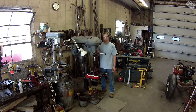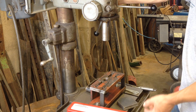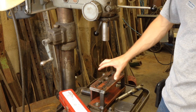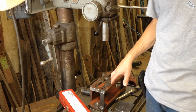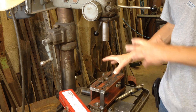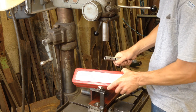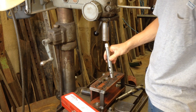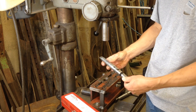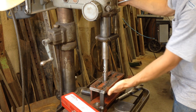I'm currently using an overpriced boring bar. I'll give you a quick rundown of how I do this and then go through the details. This little table is actually an old plow part. I stuck a one-inch ball bearing in it — we'll get more details in a second. The bearing just keeps this boring bar from wandering side to side and takes a lot of pressure off the spindle.